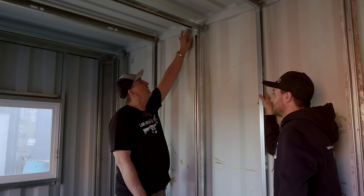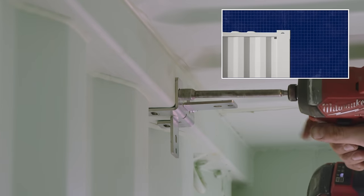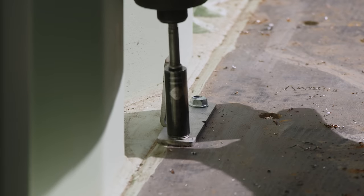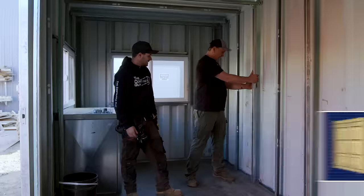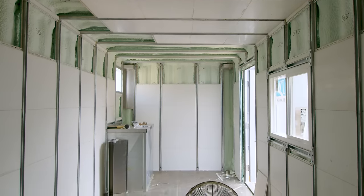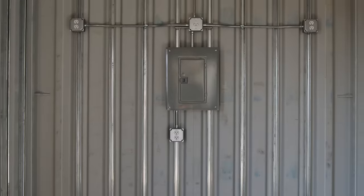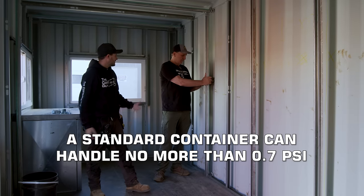Let's go inside. I'd like to show you our strut line system — there's no welding here at all. We're doing this whole office, not a speck of welding. That's a hollow square tube. You're not creating a leak spot? No. You thought that out. And then at the bottom, we just go through the wood floor and we don't go all the way through — so it's pretty stiff. That'll handle 1,500 pounds. We can get spray foam in every corrugation — we've had it engineered for blast resistance, to handle X amount of psi of blast at X amount of feet away.